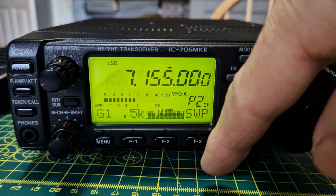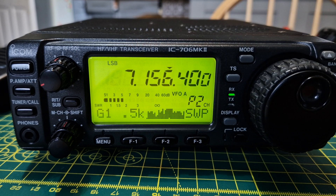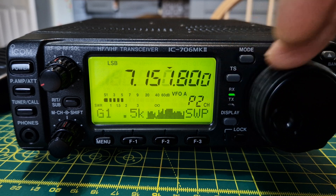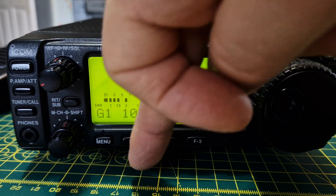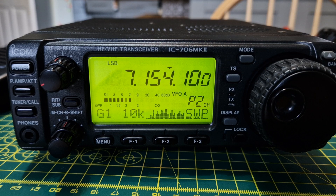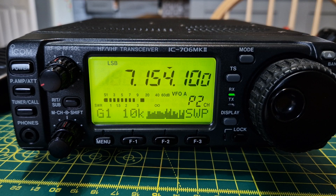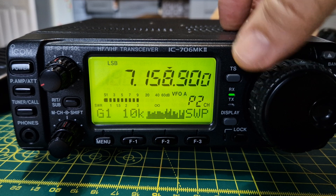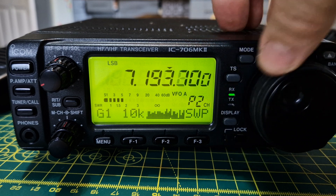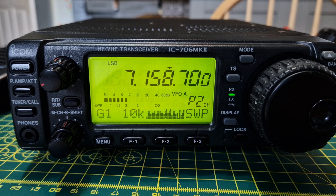Press F1 to do another sweep, then you can tune through. When it stops, look for the small white dot at the bottom of the matrix display. Go back to a bigger sweep — 10k — push briefly for the sweep, stop it, then move the white dot to a peak. There's a peak here, so it is usable and looks quite nice.